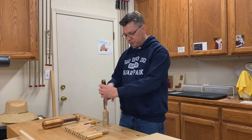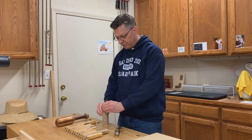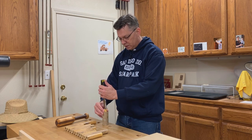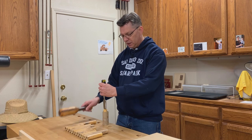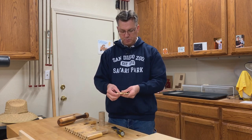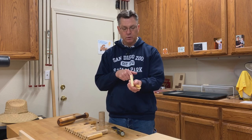The circle looks complete, so I give it a nice firm hit. Then I gather up my pieces — now I have my first split. I hold them together, place the chisel back, trying to get perpendicular to my first split while also making the circle complete in the reflection. Then another good hit. Hopefully what I end up with is four splits that are somewhat even, giving me flat straight surfaces and a section of straight grain running on the inside.